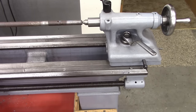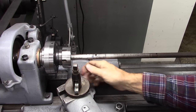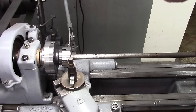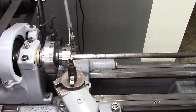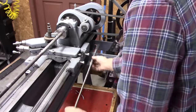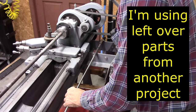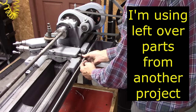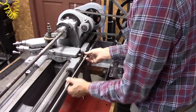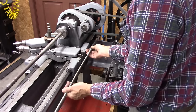The way I'm going to do this, I'm going to line up the tool, which I've just barely got in there, with each snap ring. Like that right there. Perfectly lined up. Then on the back side of the lathe, I'm going to mount this bar right there. And where these screw holes are, probably a tapering jig hooked in right there, I'm going to bolt a hook on there. And that hook will be a stop for threaded locking collars on this shaft. And this will pivot so that I can lift the rod up out of the hook and go on to the next one.